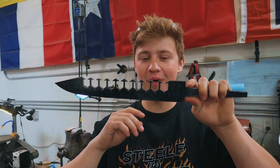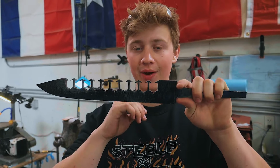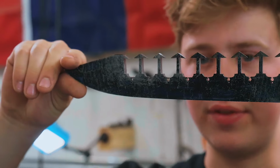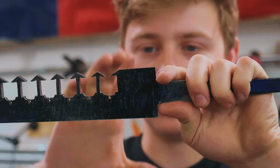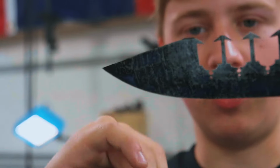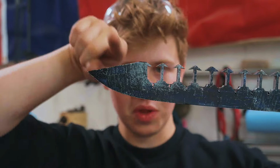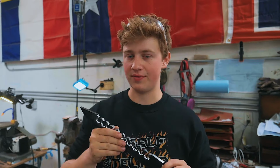Okay guys, so I had a little issue. I kind of waited a little bit to talk about it to see how it played out, but as I was bringing down the spines of the teeth here, they got a little bit lower than the back of this ricasso. So we're just gonna bring that ricasso down as well as bring that tip to a point where it meets that little last spine there. So I'm gonna go ahead and hop into the grinding room, grind it down just a little bit, about 50 thousandths of an inch or so, and we'll get back to die filing.